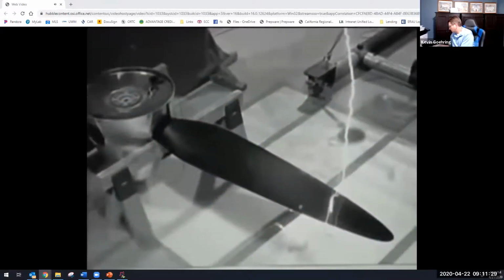Unless you have access to the overhaul manuals for the blades and the standard practices manual, you will need to contact your prop shop or Hartzell product support. The important thing to remember is that regardless of the temporary inspection results, the propeller must be torn down and inspected before being returned to full service. The damage we are concerned about includes possible arcing of the parts or superheating of the components. Both of these could lead to failure.